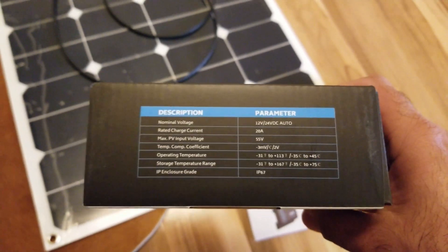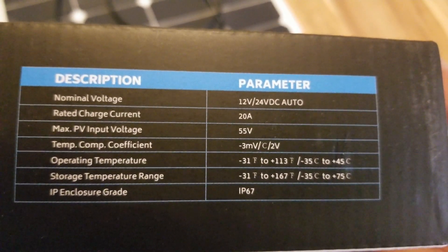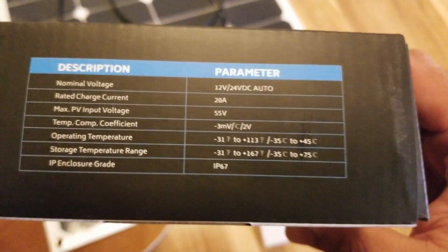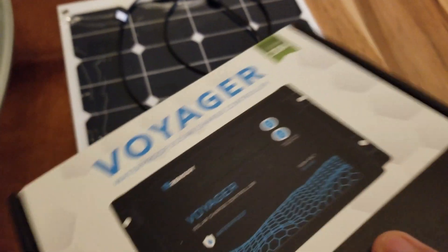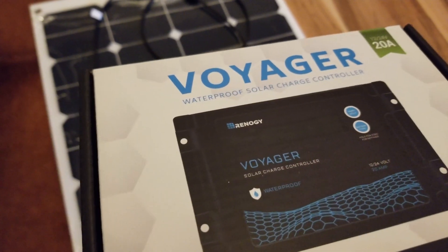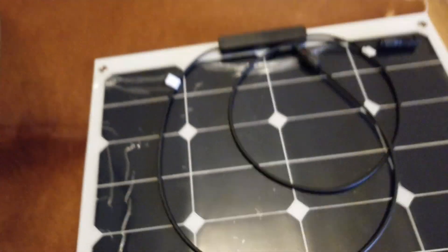It's got a built-in temperature sensor and an external temperature sensor if you want it. I've got a Victron BMV 712 so I don't really need that. It's rated minus 35 to plus 45°C working range, so it should be okay. It takes 20 amps — I couldn't get the 10-amp one even though I only have 100 watts of panels. The 10-amp one would do; that's 120 watts at 12V. I got the 20-amp one which is a bit oversized, but anyway.